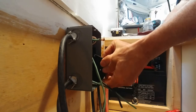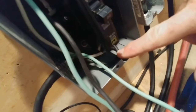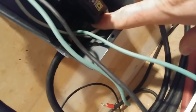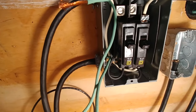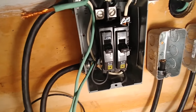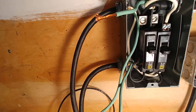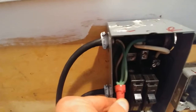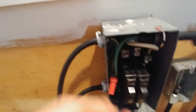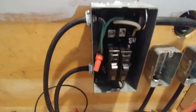Now I'm going to snap it in. You can see that black wire right there, screwed in underneath. I've got both breakers in, both black wires in, both white wires in. Now all I've got to do is strip these green wires and put a wire nut on them — they'll all be bound together. I've trimmed all those back and joined all three with a wire nut, and the cover can be put back on this, and it's ready to be activated.